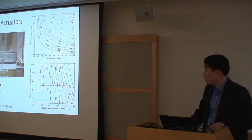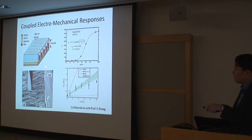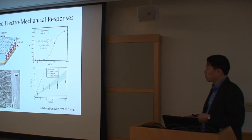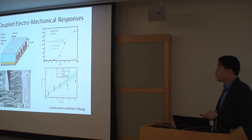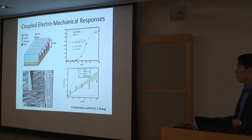After we've seen the conducting polymers, we can also try to build nanowires of those conducting polymers by using silica templates. Therefore we can synthesize those nanowires, and build them into the conventional polymer PDMS, which is widely used in polymer science. We can show that both the dielectric response and the elastic modulus response turn out to be changed. We can modulate those numbers at the same time, mixing the conducting polymer phase with the normal polymer phase. Therefore we can couple the electrode to make a response, maybe used for automatic sensing processes.